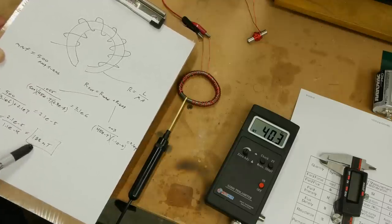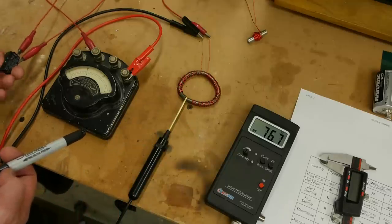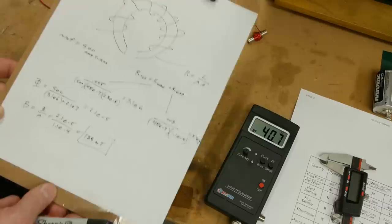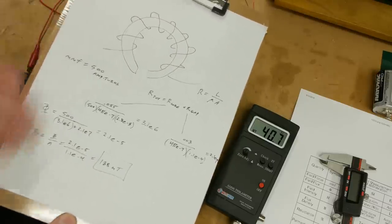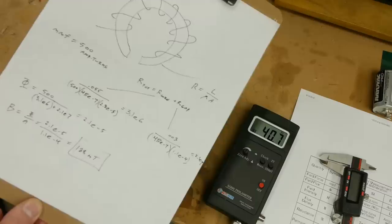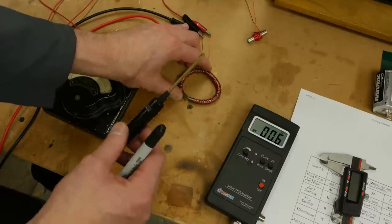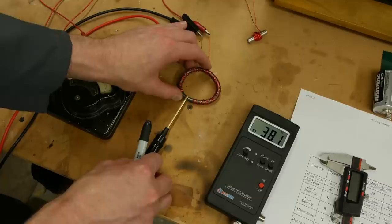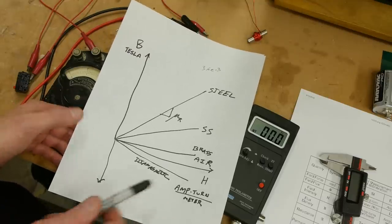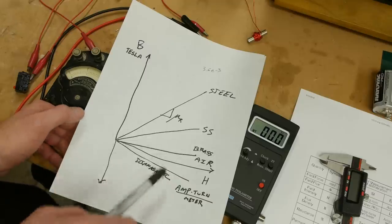The total flux comes out to 2.1 × 10⁻⁵ Webers. Dividing by the gap area gives a predicted flux density of about 188 millitesla. Let's try it out: we're already measuring 40 millitesla with no current flowing. Turning the power on gives about 100 millitesla — a little more than half of what we estimated. The point of this isn't to show rigorous math; even being within a factor of two starting from universal constants and geometry is quite good. However, something's wrong: even without any current flowing the meter reads 40 millitesla in the gap. If H is zero, we shouldn't be getting any B at all — so our simple linear graph is slightly inaccurate.